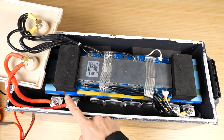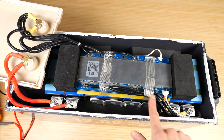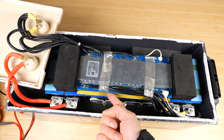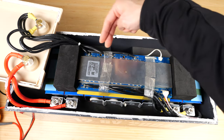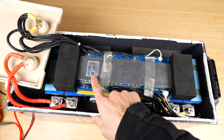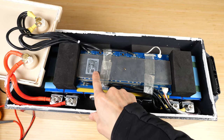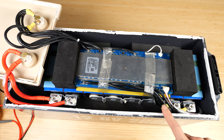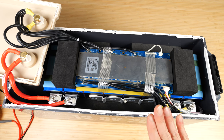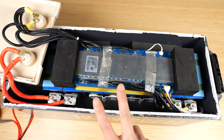The positive goes in here, six wires come out of the negative, and this right here is the BMS module. There are actually two circuit boards. Three of the wires go into one board, and three go to what looks to be an identical board on the bottom. There are a bunch of high power transistors, and the three wires go from here to the output — another three on the bottom board go to the output as well. The BMS module says Power Queen, so they made this themselves. If it ever fails, I don't think Power Queen will sell you a replacement, but you can probably buy another one and wire it in yourself. The battery balancer keeps voltages across all cells equal — if one has a higher voltage, it drains that cell so the voltage is equalized across all cells.